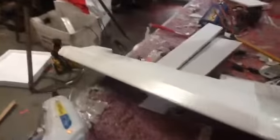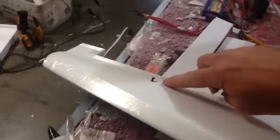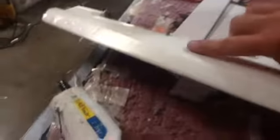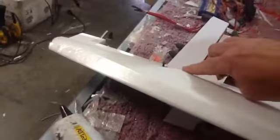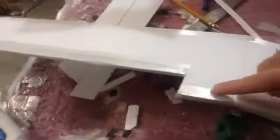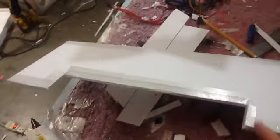So here's the wing — I have a good airfoil on it. The only thing that I wish I'd done differently, a smaller servo would have helped out, but I didn't have any. So there's a little bubble right here — that could be a bad thing, but the good thing is it's the same thing on the other side, so it's equal on both sides. I cut a 45 degree angle on the bottom side, and I taped the edges just to reinforce it.